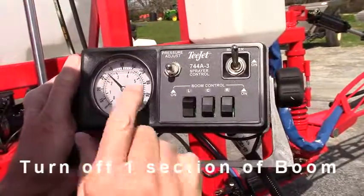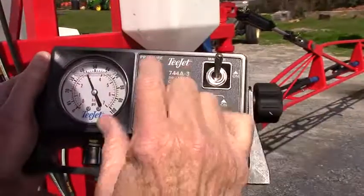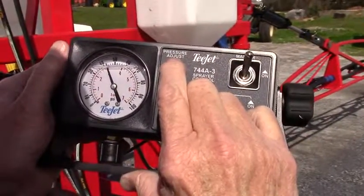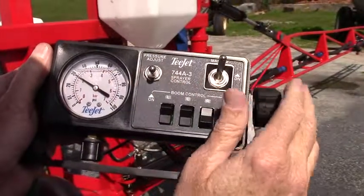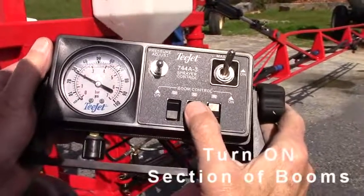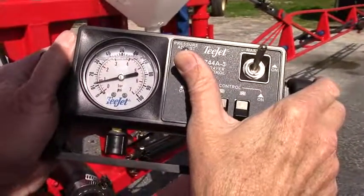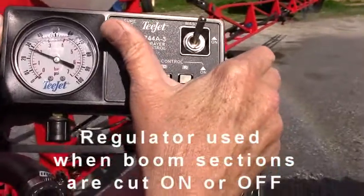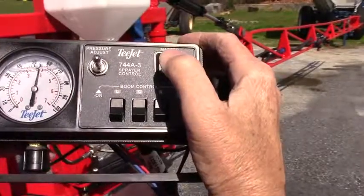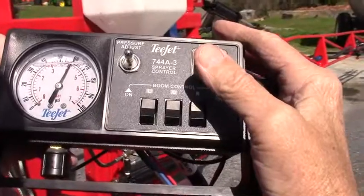With a speed-pressure system, when you turn off one section, the pressure goes up. Close all sections and it continues to go up. The only way you can adjust that is with this regulator — get it back down to 30 pounds. You can see it's sensitive. If you turn a section back on, the pressure goes even less because you don't have as much flow, and then you've got to run it back up. That's one of the disadvantages of not having a metered system. Turn it off — the pressure goes up. It has to have the same volume but fewer places to go, so the pressure increases.